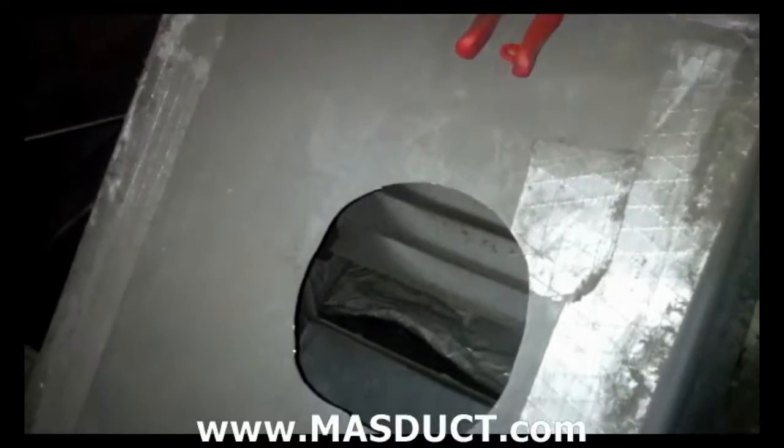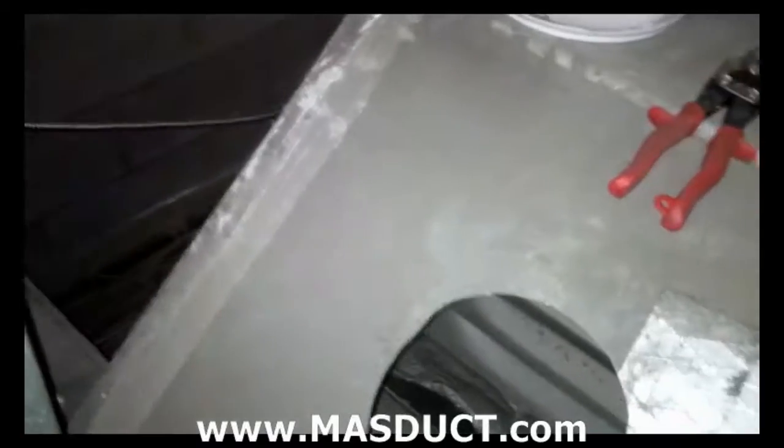I thought I would take a moment here to show you how to apply a sheet metal patch onto a main plenum of the duct system that we've just cleaned. So we've got our main hole here. This is where our suction was, and this serves as a main plenum for all our offshoots. It's kind of a dirty, dusty area here, but we've got offshoots all over the place that all come back to this main plenum. These all have smaller holes in them for skip holes, and we worked everything back to our main plenum. We've cleaned that up, and now we're gonna close this up.